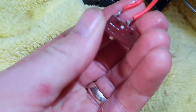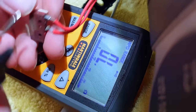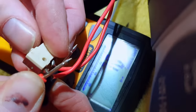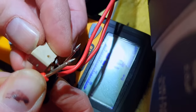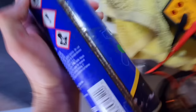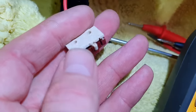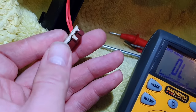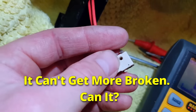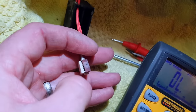There's our switch — and it is wet. The micro switch has failed. I've given it a good spray out with some carb cleaner but nothing's happening, so I'm going to split it open here. I'll try to take the contacts out and actually clean them and see where we go, because the boiler is not going to work without this working. If it falls apart, it falls apart — it's going to work or it's not, and either way this is going to be the culprit. So let's risk it for a biscuit.